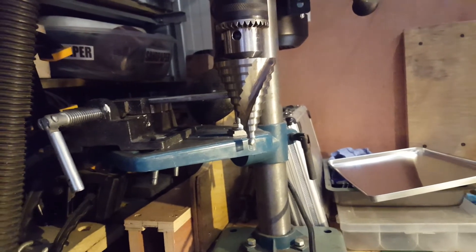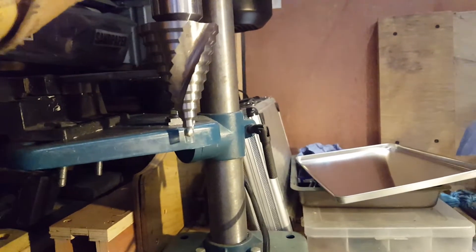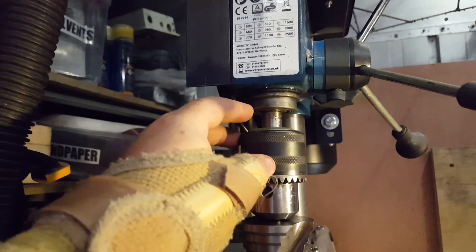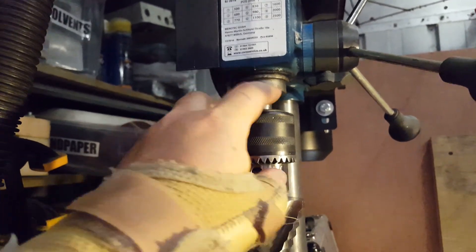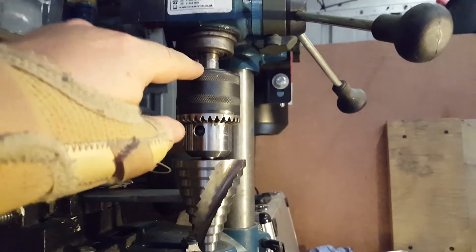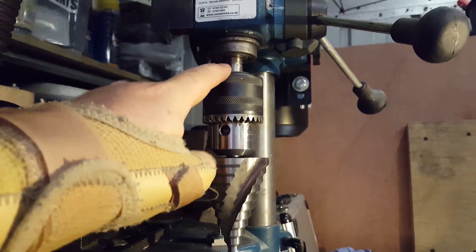It's a wee bit dubious, and I'm starting to think it would be safer if I managed to find the right kind of pipe online — like a 45 and a half mil pipe, 2mil wall diameter, would give me a half mil clearance. So I could get one of those sections of pipe and then weld the stuff I want onto it, and that would be much safer.